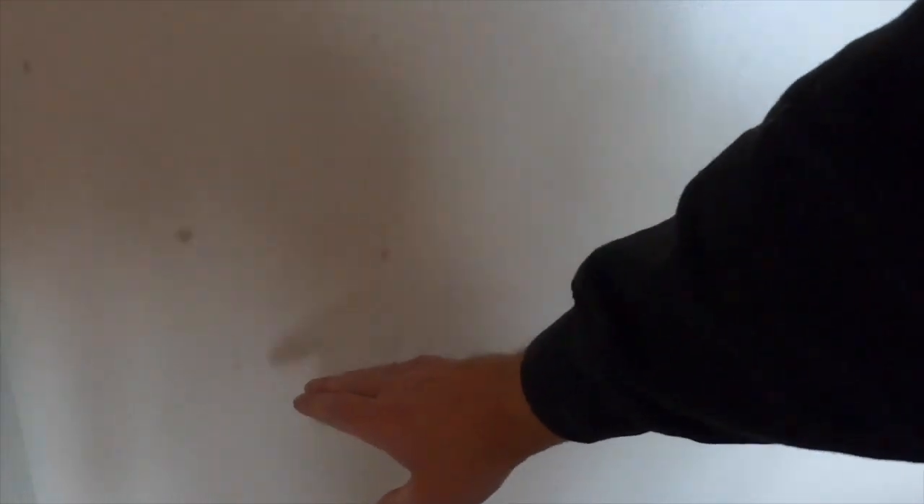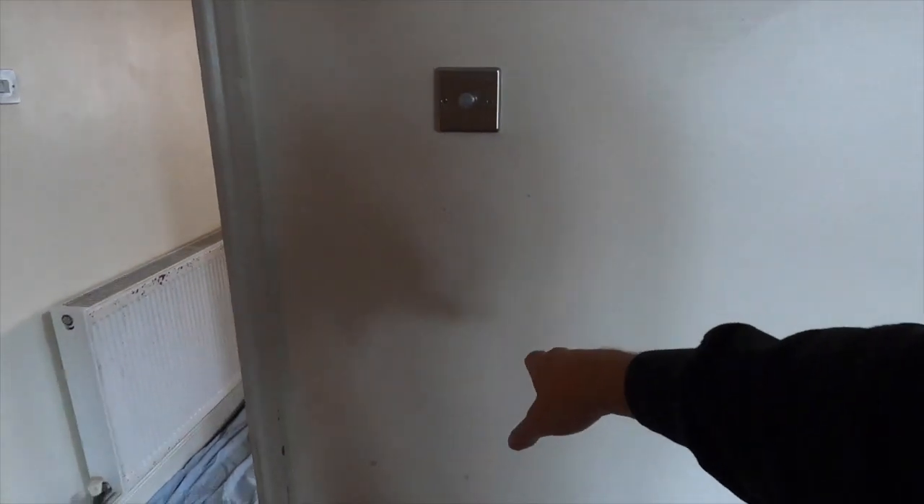In this particular house, later on the kitchen is going to be replaced. So we're getting things in like the downlights ready for the kitchen — there's no point doing that twice. We're planning on bringing everything up to regulation height and Part M. For sockets, they're 450mm to the bottom of the socket. Light switches are all coming down to 1200mm to the top. Everyone's got their own take on it — that's just how we do it.